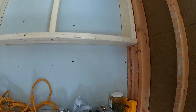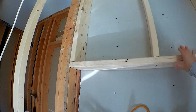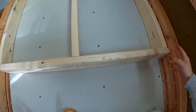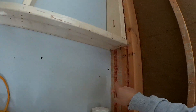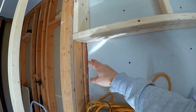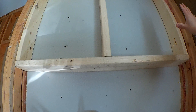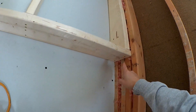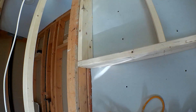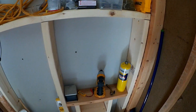The other thing I did to make sure that this was secure — even though it's not really a structural wall — I did want to make sure it was secure and not just nailed up. I actually put a jack stud here and a jack stud here and had to notch it — that was the only way I could really do it. It is holding the weight of this board, which is also holding the weight of this as well. I secured it with some screws, not just nails, so I got a screw in here and screws up there. On the bottom it's just nailed in place onto the sides and at the bottom.